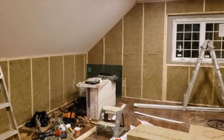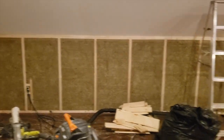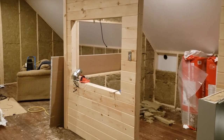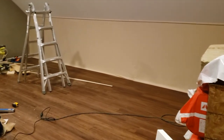I just finished insulating — it's basically Rockwool Safe and Sound throughout. Nothing too fancy but it's all through the room now, with these three walls completely done. I need to build some panels for the wall near the stairwell since I can't frame it up without interfering with the stairs. I'll leave one wall for now to hear how it sounds, and the other side of the booth will have a couch and other furniture, so I'm not too worried about that side.